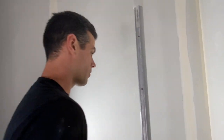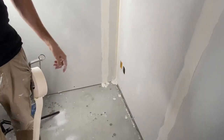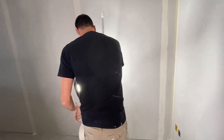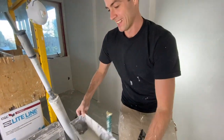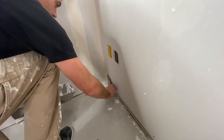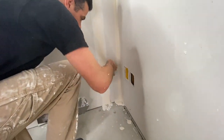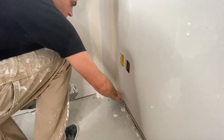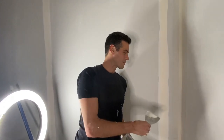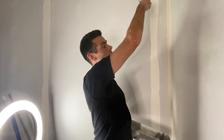I'm very happy with that. Come take a close look — you can see it's perfectly feathered in one pass, it's left mud over top of the tape, and a giant mess at the bottom of the floor. But the contractor's cleanup guys can take care of that. Well, we're not going to leave it like that — that's hideous. I don't usually clean all of it up though; I've got to give the apprentices some work to do. Basically at this stage I'll get most of it. If you get a little bit less mud — I was a little heavy there — and you go from the bottom up, you can leave it at the top which looks like a nasty mess but cleans up really easy.